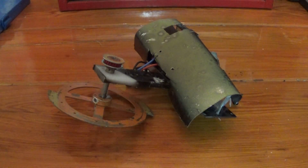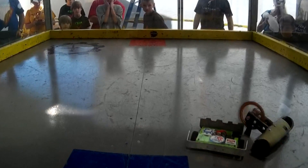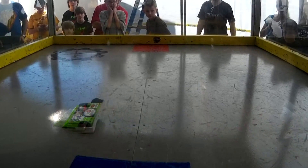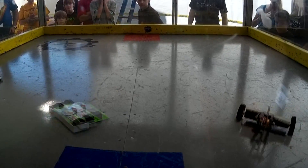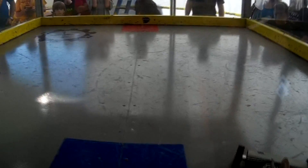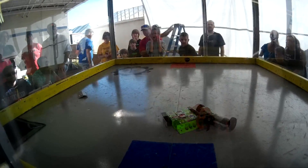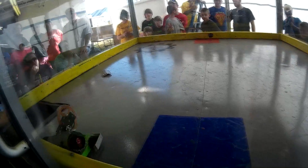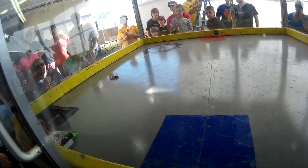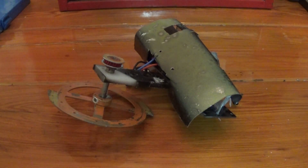For Jack Chop's first actual fight, it was up against Cyanotoxin, which was also the winner of the antweight class. I was doing alright for a minute — spinning really well, able to navigate around him. I hit his titanium wedge and ripped it clean off, but in the process my weapon itself came loose. Because I only had a shaft collar on one end of the shaft, it broke loose of its mounts, threw the belts, and I was weaponless. I was really happy with how the robot drove — much more controllable than before — but he was able to dump me right into the pit.